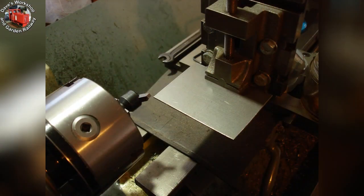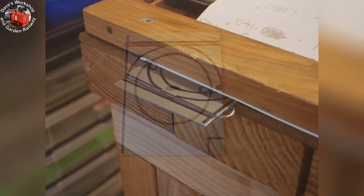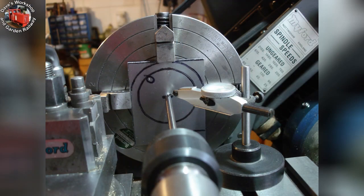Flycutting the datum face for the smokebox front plate. It is 1.6mm steel sheet — I have a lifetime supply. Two edges have been milled square, then the plate marked out using permanent marker pen ink, and scribing with the digital caliper and dividers. The top waist piece cut off with the hacksaw. A complicated way of setting up the piece to mill the third face parallel. Front plate set up in the four-jaw, with the wobbler bar in the center-punched hole to get it running true.